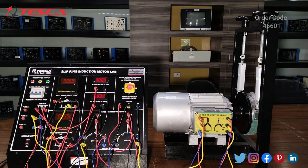After the connections are done, we will switch on the main supply of this trainer unit. A 3-pin plug is provided with this trainer which we connect to the main single-phase AC supply so the meters get power and turn on. There is another wire which needs to be connected to the three-phase supply. We have to connect that to the three-phase variac, then switch on the three-pole MCB. The three dual LEDs will indicate when proper three-phase line-to-line supply is received.